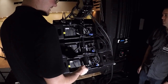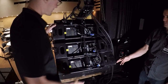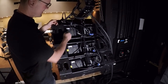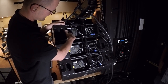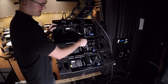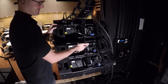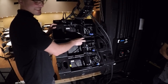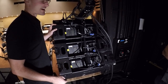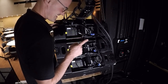Signal. Power. Line arrays. So the one thing I didn't really explain is for angles. When you're looking up the angles to set where the boxes should point, you just have to follow this diagram of where you put the pins. It's got this side which shows you where the pins go in the actual speaker, and it's got this side to show where the pin goes in the bar — this thing that's removable. So you just follow that grid and it shows you the angle that you get depending on where you put the pins. You'll be able to figure that out no problem. That is it.